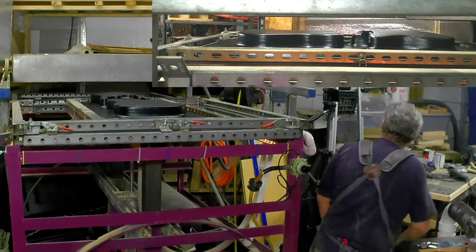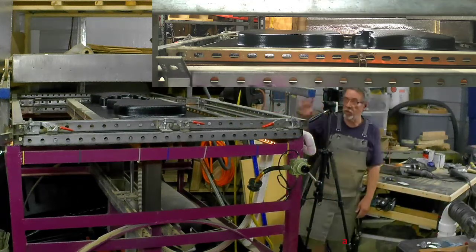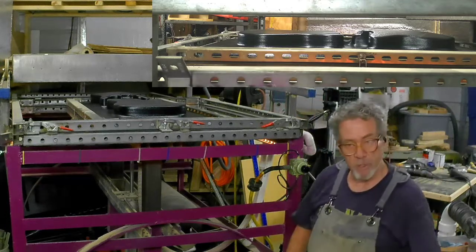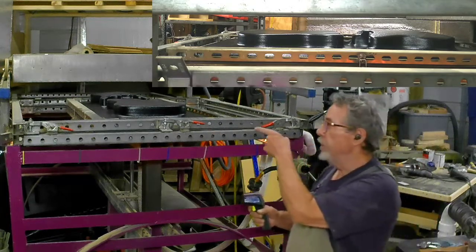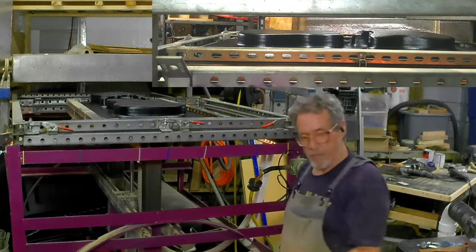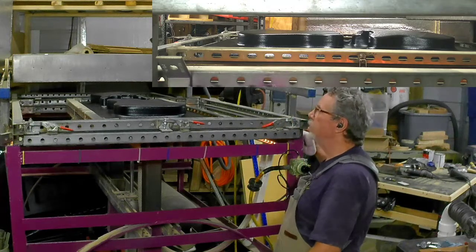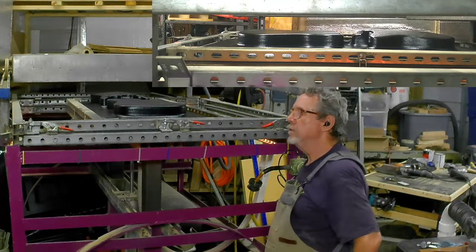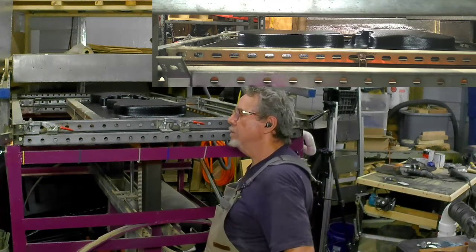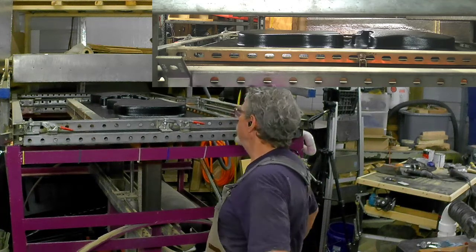So, like right now, I don't know what it's got sitting on it. It's holding about 10 right now because it's still open, and it's got 10 inches of vacuum still pulling on that part right this second. So it's still sucking it. And every now and then you can hear it creak. You hear it creak, that's in. Okay, it's at 133. We can turn the vacuum off. Listen to what's going to happen when I turn this off. Boy, that's tight. That makes some tight parts.